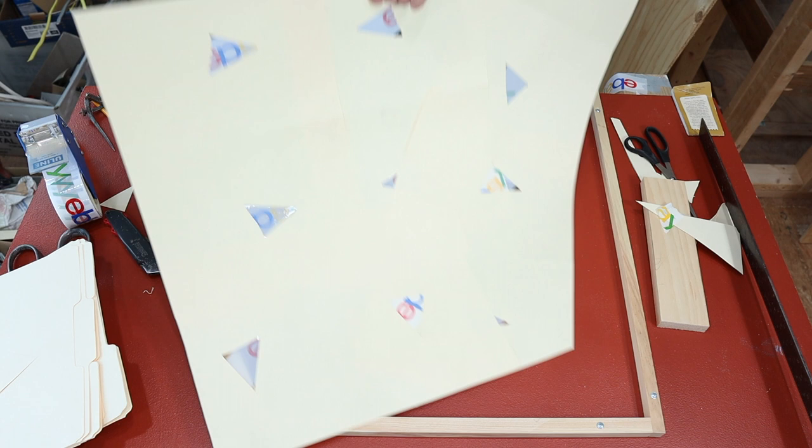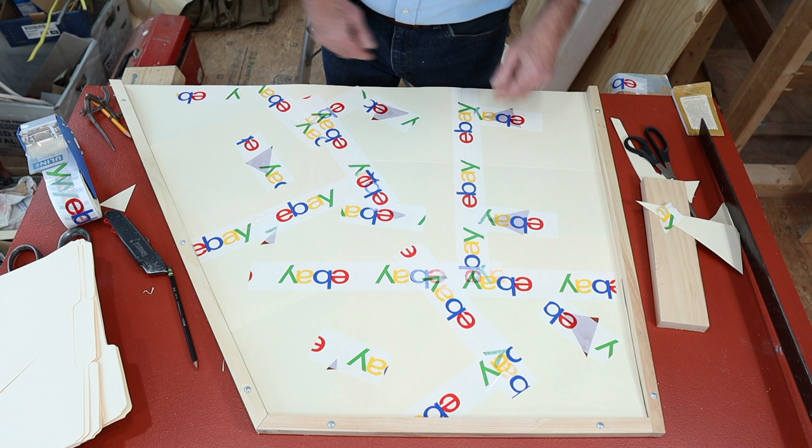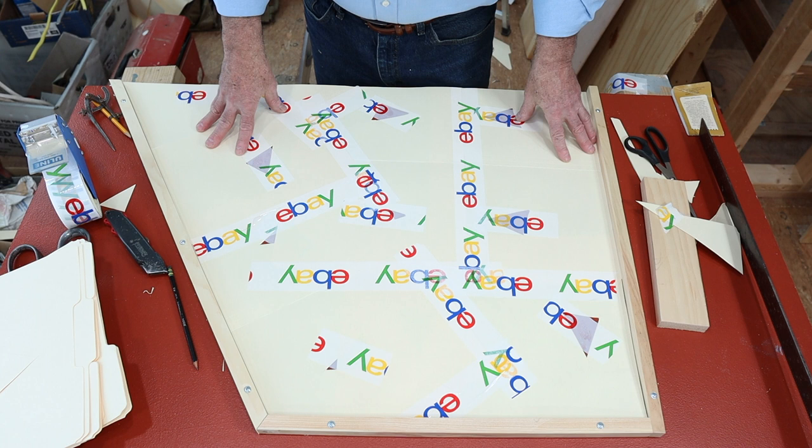What I'm going to do is trim it right here, because maybe that's necessary for our hypothetical situation — that this edge be just right also, and it is. So once your pattern is all made and all your edges are taped, it's then a simple process to just peel it up. Even if it's a big sheet, it'll hold together. That tape on the backside allows you to lay your pattern onto your sheet goods, stick it down, trace and cut and fit and amaze not only yourself but anyone else who might be around.